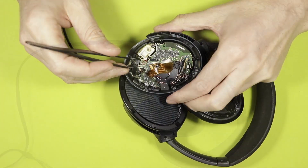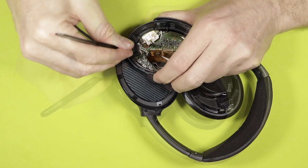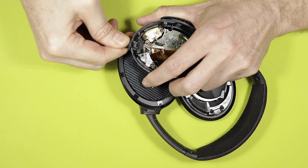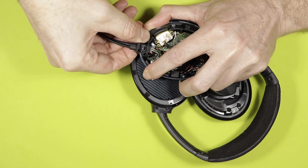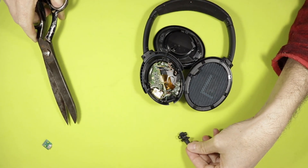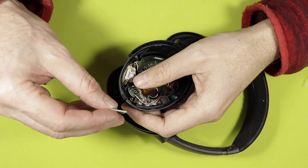You can leave it attached by that cable. Let's remove the glue that keeps the cables attached to the earcap. Once we remove the glue, we carefully try to lift this cable away from the case. Now I just need to cut it — and this is the micro USB that I want to solder onto those cables that I just cut.